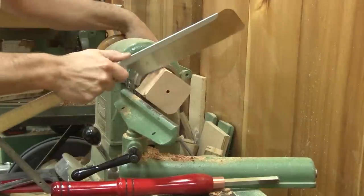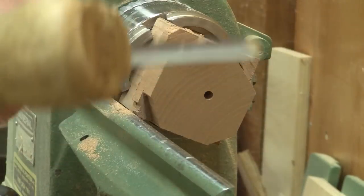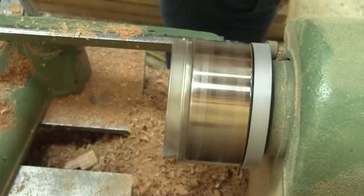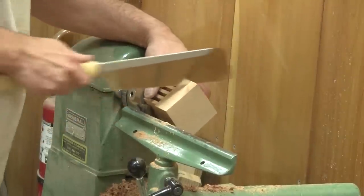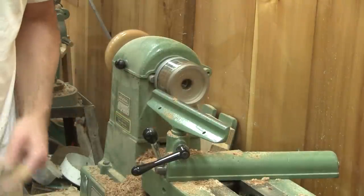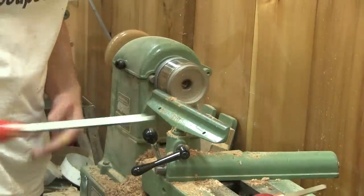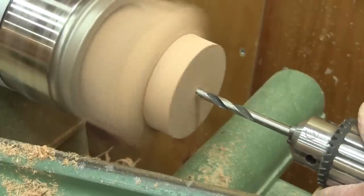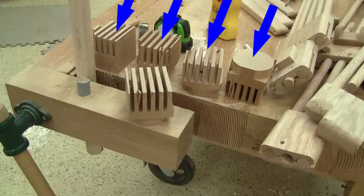To help me turn the bottom, I cut the corners and remove some wood. Now I can turn it round. This doesn't hold that well on the chuck — I break my first blank. I cut more box joints and turn its bottom. It takes me a lot of tries to get something usable. When I'm finally satisfied, I drill the pivot hole. If you wonder how many times I made this — five times. You can see the four broken ones and the one I'll use.